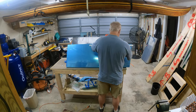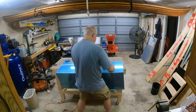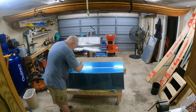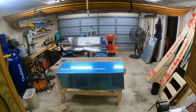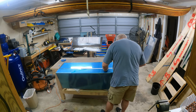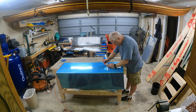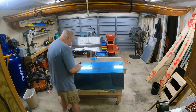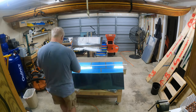Taking a picture for the build log. Now here I'm starting to prepare the skins — they just need to be dimpled for the horizontal stabilizer. I'm using a straight edge ruler and a soldering iron to remove the plastic. You don't have to do this, especially if you're going to paint the plane, which I am going to do. But knowing these are going to have to sit around for a year — that's the lead time on my quick build wings and quick build fuselage — I wanted to give it the extra protection. So I'm taking the extra time and leaving as much of the vinyl on as I can, so while this sits around for the next year waiting for the rest of the plane to arrive, I don't have to worry about scratches on the skin. Extra work, but I did it anyway.